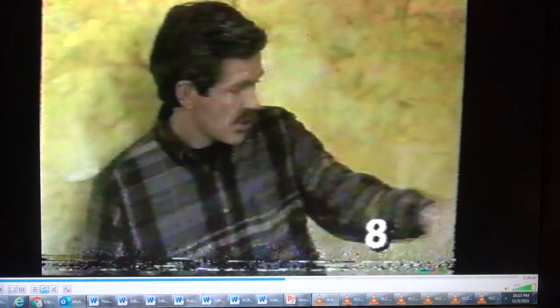The first thing we want to do is lay out all of our baseboards and get those leveled in. The baseboards are unique because of this notch here, which later on we'll use to pull all of the boards together. You want your base frame to be level, and if your floor is off a little bit, you can just shim underneath the base.